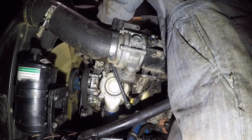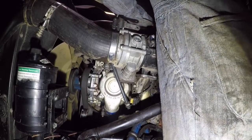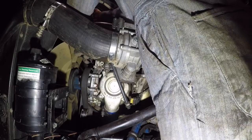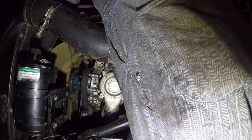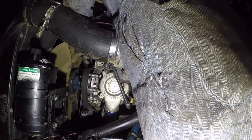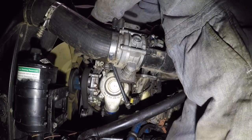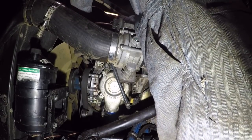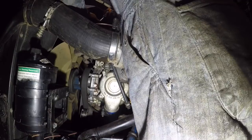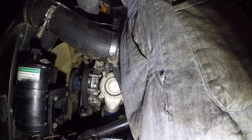I know there was a lot of discussion on the one video that I had about that tool that I bought, it was called a flange wizard. And I found out a good purpose and a good use for that tool. That tool came with a sliding soapstone holder that you could mark your line with. So I thought, that way I don't have to pull those guards off again and mess with that. There were those dust shields that went over the dual cone seals where the center of the hub was. And with that tool being on there, using it as a torch guide to cut, I couldn't get my tip close enough with those dust shields on. I had to grind the rivets out and knock them out.